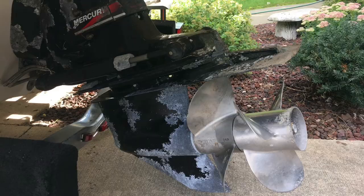The next big task on my list is to pay attention to the outdrive. It needs to be repainted and the anodes need to be changed. The painting process goes like this: I'm first going to do some sanding, remove any loose paint and loose chips, and get it sanded to a fairly smooth surface.